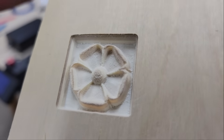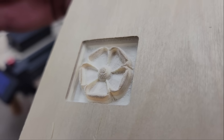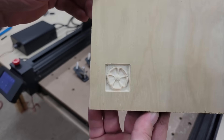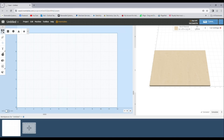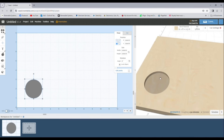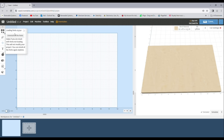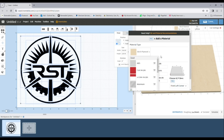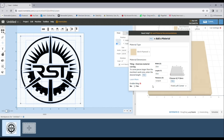After having success with the test files, I decided to create a custom G-code to try. For that I needed CAM software, and I chose Easel Pro for the job because it seemed to be the most affordable and user-friendly with good reviews. Since I just carved two files, I wanted to try cutting next, so I imported my channel logo as an SVG file to carve and cut out of a piece of ¾-inch birch plywood. Then I set the origin to the front left corner of the material and checked the cut settings.